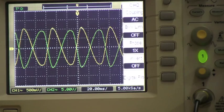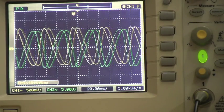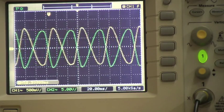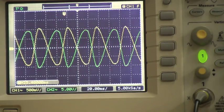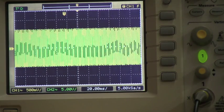Additionally, another thing that the oscilloscope can do is allow us to move horizontally across our function using the knob up here. As you can see, we can just see a wider range of our function by using this knob. And we can also take certain measurements. I'm going to put us back into 500 Hertz for this part.